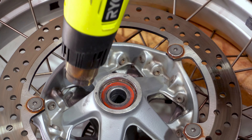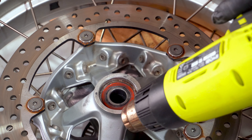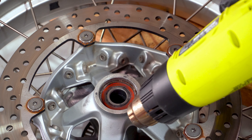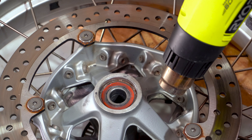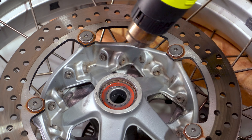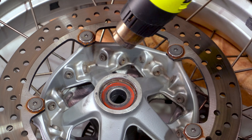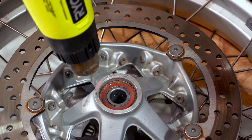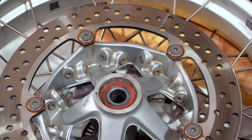I'm going to put my hot air gun on and just try to warm up this area. Just measuring how warm it is. Looking at the top of the bearing — it's got a heap of rust, I can see down the side. It's been in there for a while. I'll just spray a little bit of WD-40 down the side of it to see if that makes any difference.